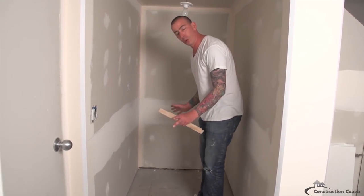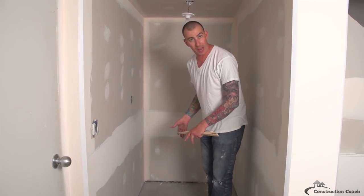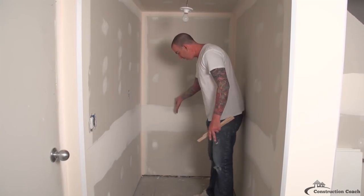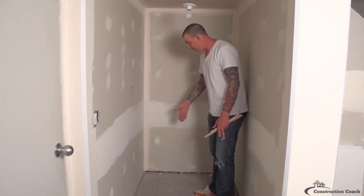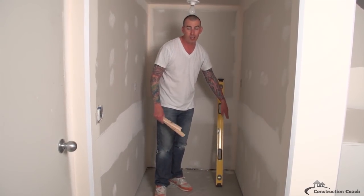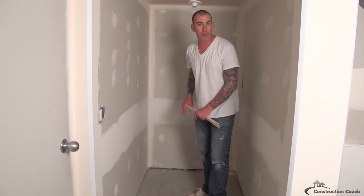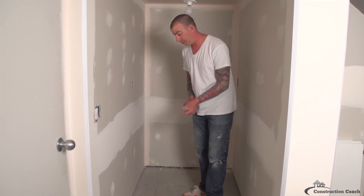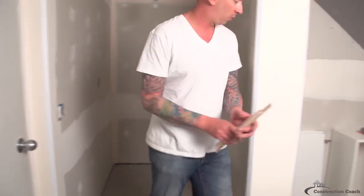I've got those two upper cabinets that I've modified to turn into base cabinets to go right between the two cover panels. And then I've got an MDF side piece that I made, like a gable, to be the one side of the fridge. And then I've got another gable on this side. And I'll put some strips across the top and measure up for starting to fabricate our laminate countertop. So let's get started. Got my shims, got my level, just going to grab my base and my drill.